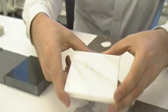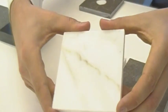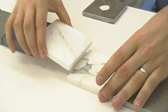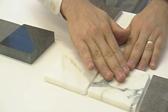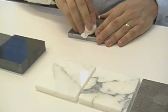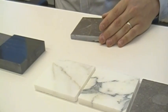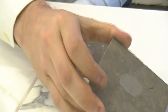Here's the polished white marble, and you'll see that took the polish right off. If you catch it in the right light, it kind of hones the material. That's part of the reason why a lot of people prefer honed white marble surfaces if they are going to use marble in the kitchen. Now on the dark marble, again, it's not that it had any more or less of a reaction — it's just that aesthetically it's going to be a lot more apparent. So when that dries, it's going to look a lot more like the big white spot you have on that limestone.